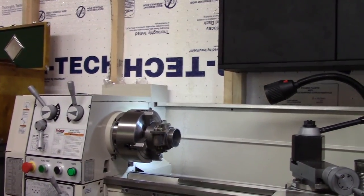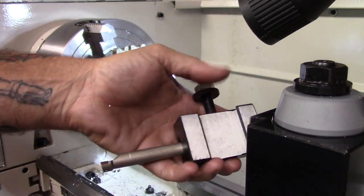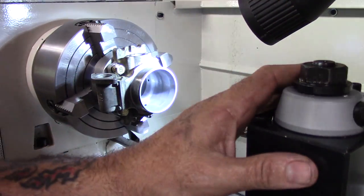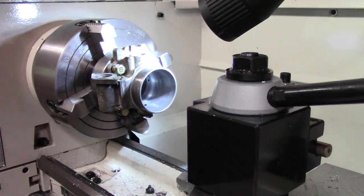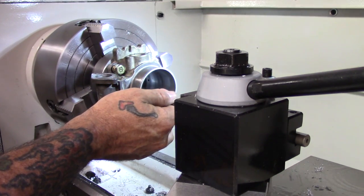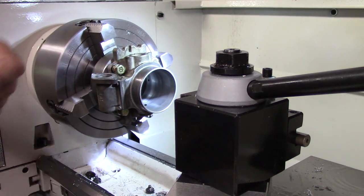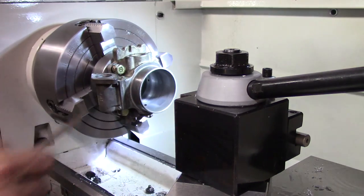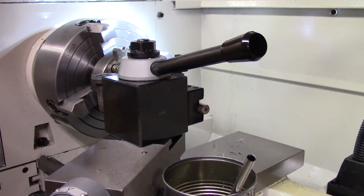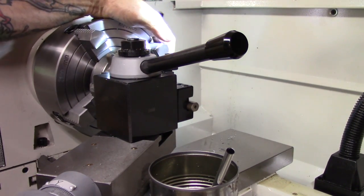Alright, let me get the boring bar set up. Alright guys, first thing we want to do is set our depth of this boring bar. We don't want it sticking out no further than it needs to be. What I'm gonna do is instead of measuring, I just stick a scale in there and see here. I'm just feeling the back side of that. About 2.5 inches, which is what I guesstimated. 243. But what I'm gonna do is just run it in there, all the way till the tool bit, the holder's touching, to make sure it ain't gonna hit nothing,